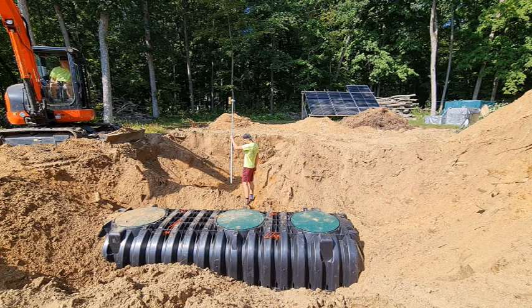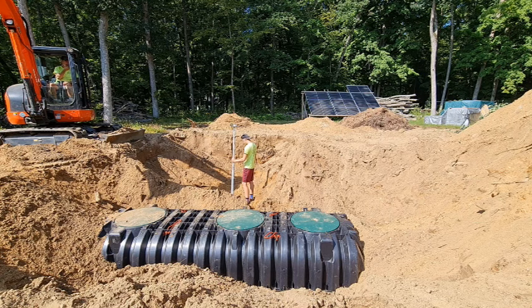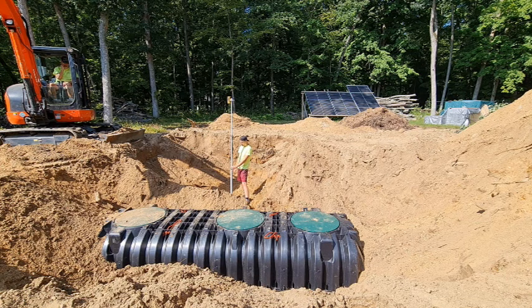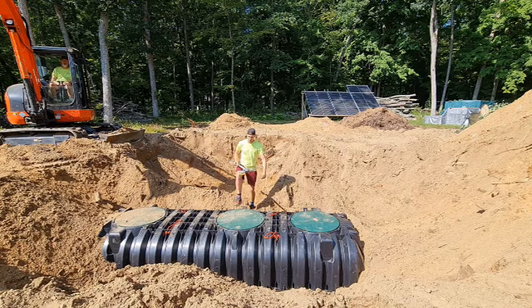Because I'm going to have at least six inches of rock under my pipe. Yep. And then the pipe is, if it's 6 inches lower than the tank, I'd be okay with that. That's 8 feet. More like 9 feet. That's probably a little too deep. 9 feet and a tenth. So for seven there, let's do 8. That's where we want to be. Okay. So I'll fill in a little bit.